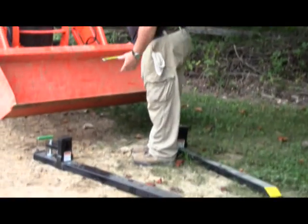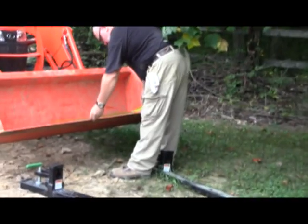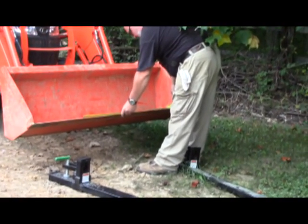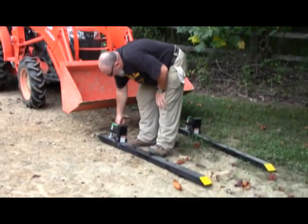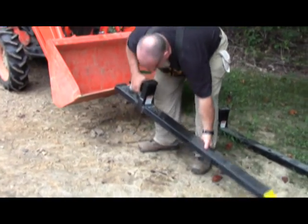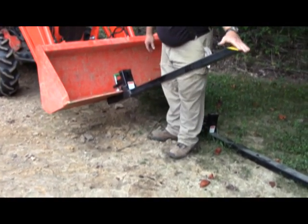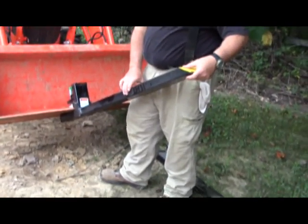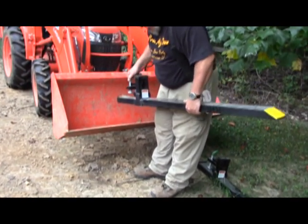We had these boxes the other day and they've been sitting around, gotten a little dusty, but we're going to put them on the tractor and see how they work. My pallet opens about 28 inches so we'll check that and make sure we're the right length. These work just like the hitch mount we bought from Titan earlier. We're going to load these up and tighten them down. They're hollow — I think the reason for that is if they sold you one big thick piece of steel like regular forklift forks it'd be pretty heavy, so this is a usable amount of weight to lift.